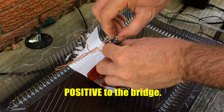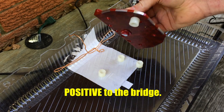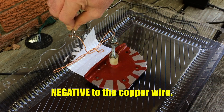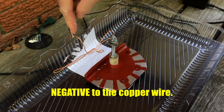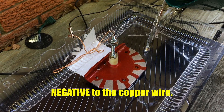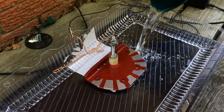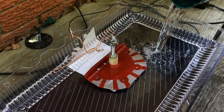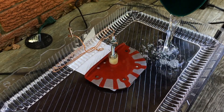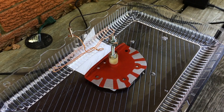I was looking for some way to attach the wire to the bridge, so I have a bolt here making contact — it has to make contact somewhere. I attach that to a copper wire running in here and it'll be covered with water. I've got two liters of water here with the salt solution. It has to be non-iodized, so I used pickling salt and it worked great. About a tablespoon of pickling salt in the two liters of water.